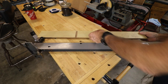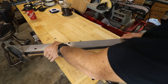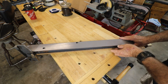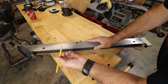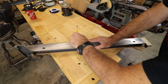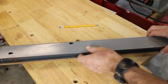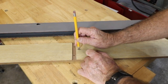You're going to do this from one side and also from the other side — let's do one side first to give you the idea. Bring the lumber up, nice and squared, even with the bottom of the metal fence so we're square. Now the simple trick: using a pencil — a sharp pencil would be even better — go down through the slot hole so it goes right through to the wood on the other side, and scribe out a nice circle. I'm just making a big circle there.